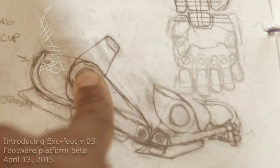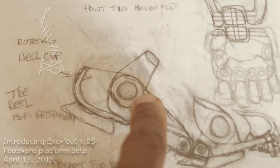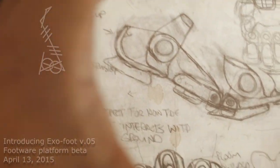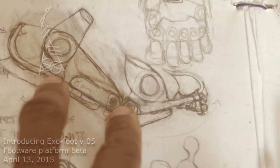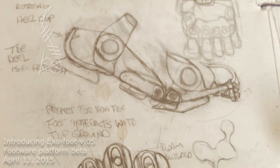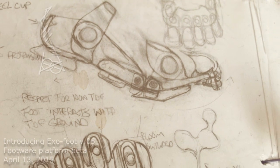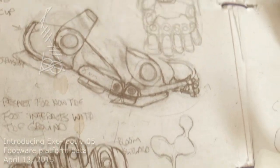Including the heel, which will have a joint in between where my ankle is and this little bone here. It'll slip right in there, and this will be a hard piece that fits over the top — that'll rotate that way. This will fold up and down as one singular piece. My foot will have full biomechanical freedom while being printable in an FDM printer. I'm going to print the toes next and see how that plays out.